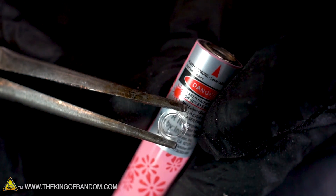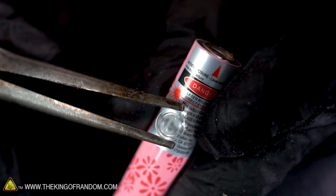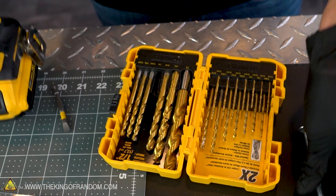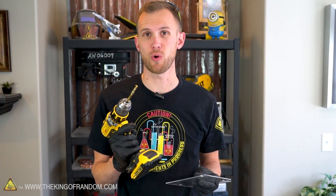You now want to drill a small hole where you marked your camera's position on your cell phone, the exact diameter of this lens that was removed from the laser pointer. On this setup the quarter inch drill bit has made a hole that is almost the perfect size for our lens, so we're going to drill another hole that same size and then try just rotating the drill bit a little bit to widen the hole enough that our lens can fit in.